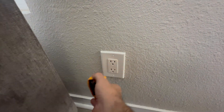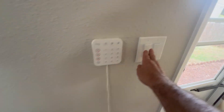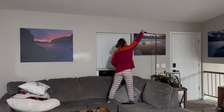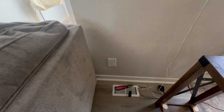What I think is happening is one of these tabs on the receptacle is not removed. I want this light switch to control something — specifically this light right here that my girlfriend has trouble reaching. It's her reading light, so I want to get that hooked up for her.